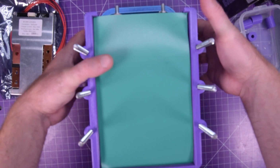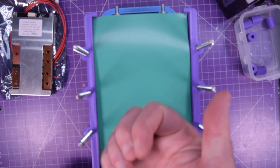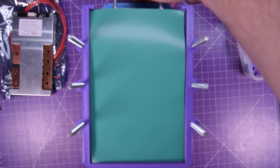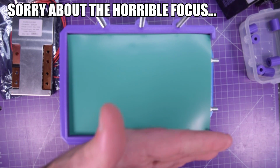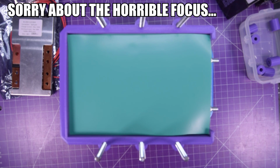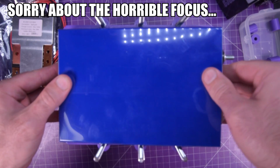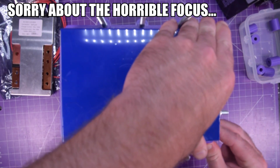So I think where we're at, yeah, positive is on this side on the right. So we need the last positive on the left. And it's starting to get kind of tall, so you guys can't see it. Maybe I'll put it over like this. It kind of makes sense, doesn't it? So very careful not to short this, but this is cell four, and that means positive needs to go over on this side, like so. And then open these up, squeeze that in.